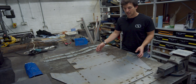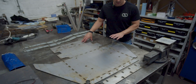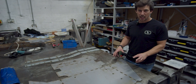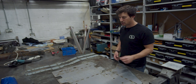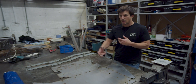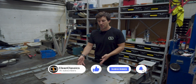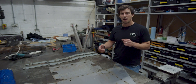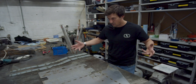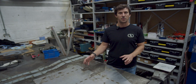This part here is going to be a charger holder for Series 1. It's a simple enough shape that we know where we're at and we know it's going to be good enough. If there's a mistake in it, it's probably going to be a hole position slightly wrong — we can slot it out in the mill, drill another hole, modify it by hand. The cost and time invested are so much less that it doesn't matter for this one that we can modify it, but critically we then know what we need to change in the CAD when we come to order a batch of this part. We can then issue that out properly, order a batch, and we know it's going to fit because we've already tested it.